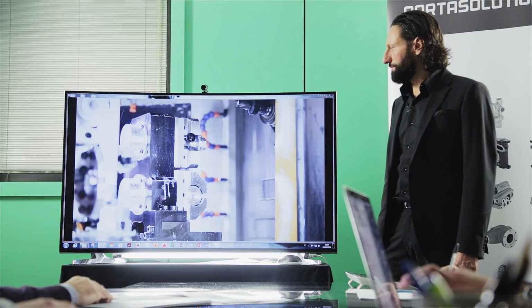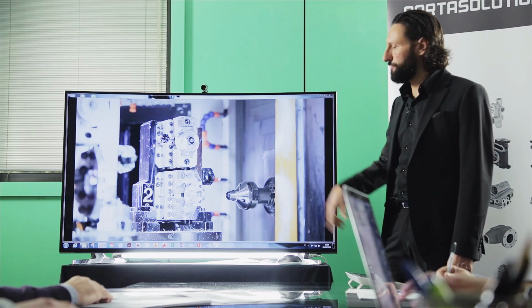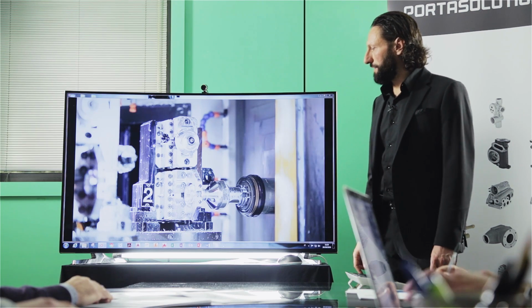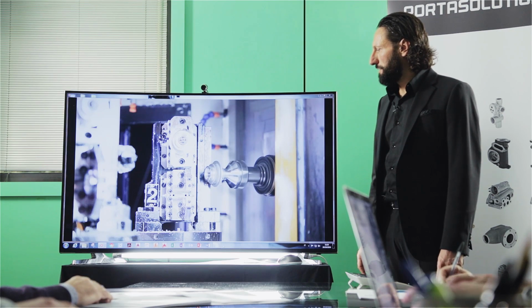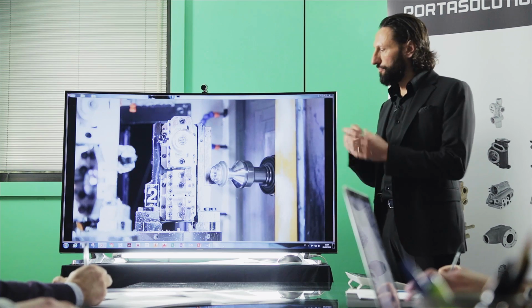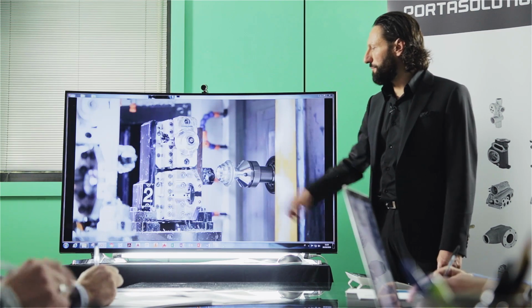at one point we change the tool, take again a collet similar to the application we saw before, and there is a tool on the turret over there. Now we're doing the turning operation, in order to maintain this concentricity compared to the main bore.